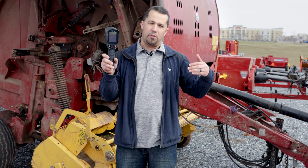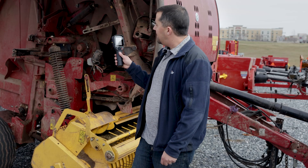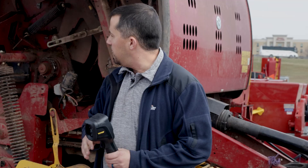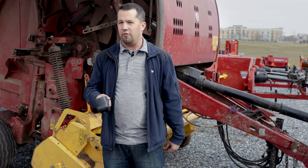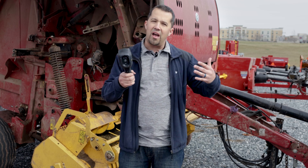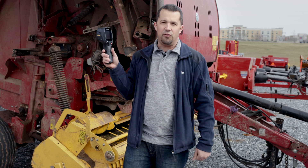What this can do for you in helping to identify problems on your equipment I think is pretty enormous, and at $229, a good enough value that I think I need to tell you about it. When it comes to identifying problems on this hay baler, I brought a tractor out here, hooked it up, let it run for 15 minutes, and very easily was able to walk around the machine, point the thermal camera at the baler, and identify all kinds of interesting things. The bearings on this ran around 70 degrees Fahrenheit or so, none of them being hot. This used baler has a lube system that auto-lubes the bearings, so it was unlikely I was going to find one running out of spec. But if you made the habit of grabbing one of these and looking at your equipment every once in a while while it was running, you could very quickly come up with a reference point of how hot your bearings normally are, and if one's running really hot, pick it out just by scanning the side of your machine.